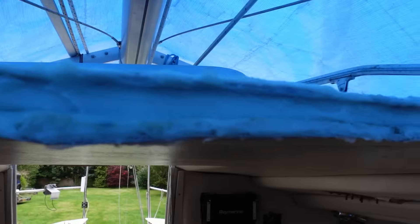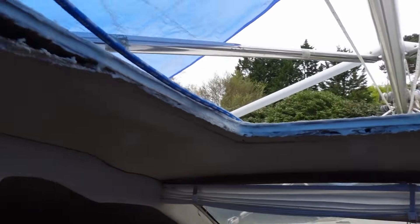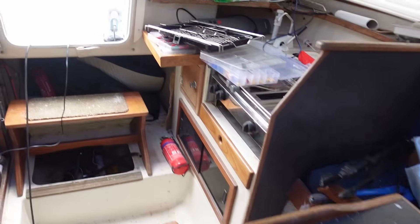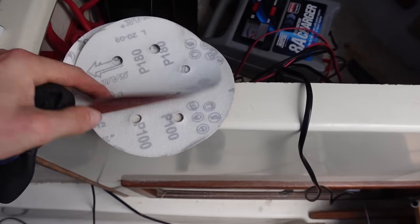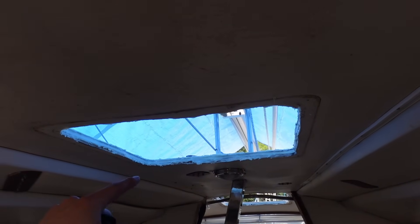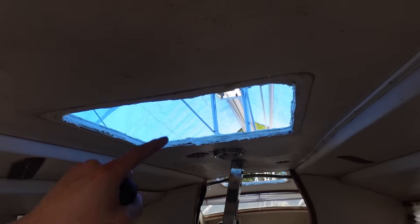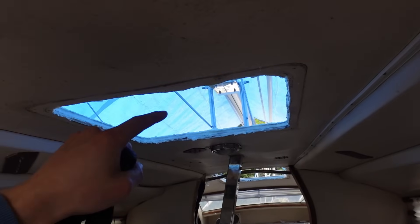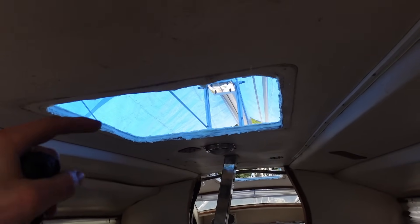Another day, another mess. The middle hatch is now filled completely with thickened epoxy. Same with the forward hatch — both completely filled. To clean up I've got a big sander with various grades of paper — there's 60 grit on it at the minute. I'll use the rougher stuff on the sides and try the finer stuff on the tops because it's gel coat. Then we can probably fit the middle hatch. I'm going to try sealing it with butyl tape because I had really good luck with that on Merakai. These windows were sealed with white sealant — whether it was silicone or something — and that leaked. So I'm going to try the butyl tape again.